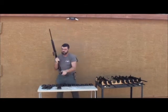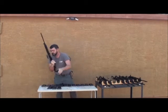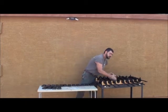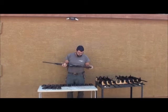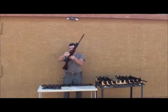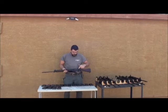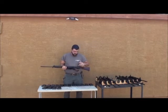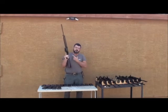That one took a little bit of extra, but still latched. This is SLR 071 — Australian wood, British handguard, U.S. grip for 922 compliance. I should mention that on all these receivers, the lockup was insufficient between the upper and the lower receiver. The lock lever is actually supposed to be angled backwards slightly to allow for wear, but I ran out of my oversized receiver locks. I have some more coming in from North Freedom Engineering to make them lock up correctly.